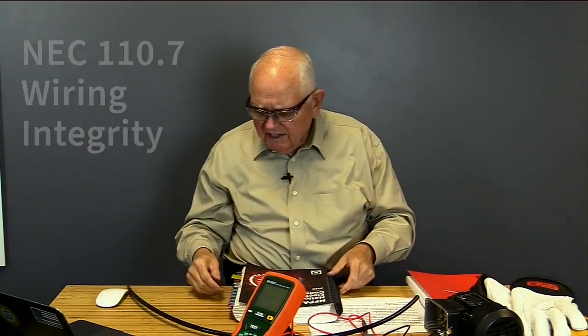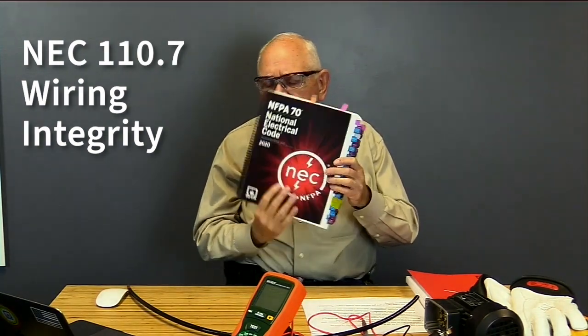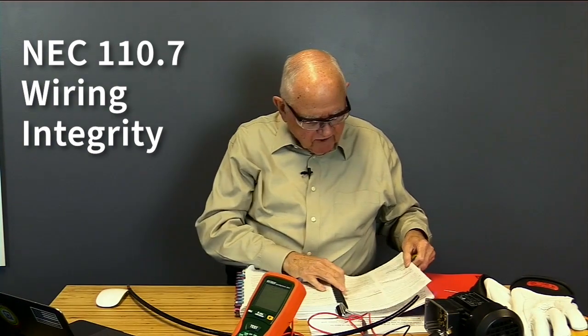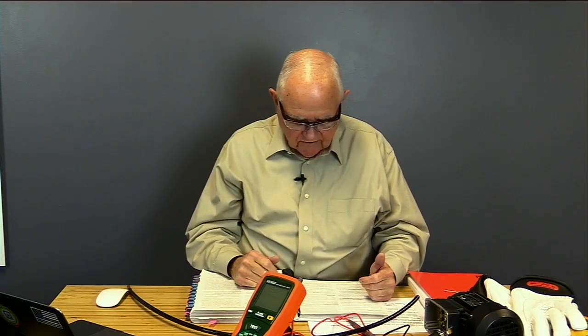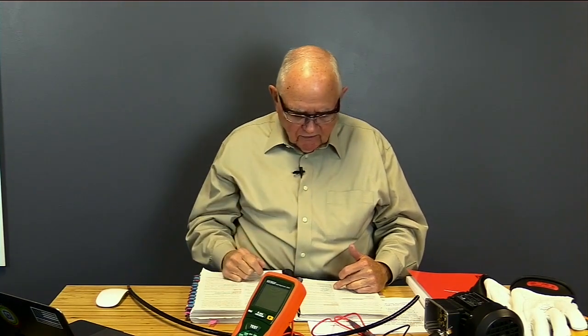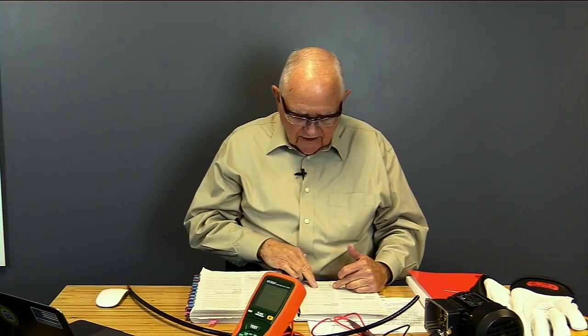So we need to take a look at, first of all, let's talk about 110.7. I'm going to go to my NEC. So I've got my 2020 National Electrical Code, the most current edition. And I'm going to go to section 110.7. Okay? It's in Article 110, which is requirements for electrical installations. And let me just read 110.7 to you. 110.7, Wiring Integrity. Completed wiring installations shall be free from short circuits, ground faults, or any connections to ground other than as required or permitted elsewhere in this code.